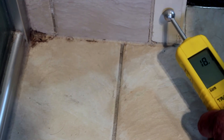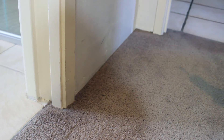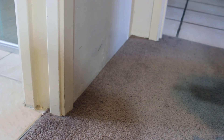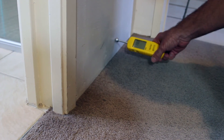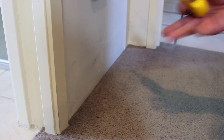This shouldn't be a problem as long as it's not escaping out of the door and the membrane continues through the door frame sufficiently. We'll take a reading on the door frame — it's probably up slightly, although there is fixing down here so I would say that's probably still acceptable, especially when we compare it to the other door. The correct way to check whether the shower cubicle is leaking is to check the walls opposite. In this location the wall backs onto the hallway, so we're able to test that wall, and the readings are within acceptable limits — telling us moisture is not coming through from the shower cubicle.